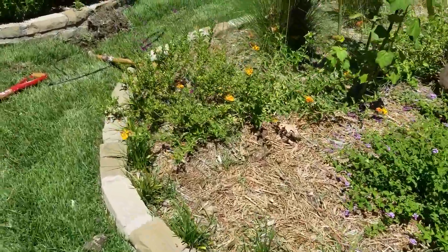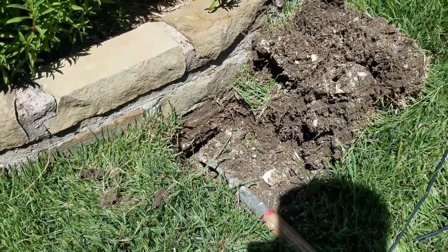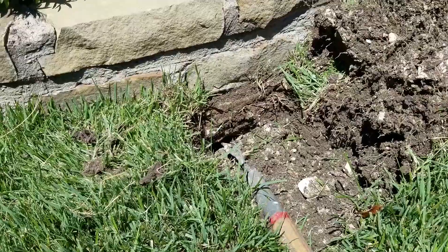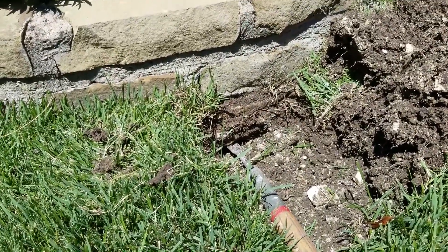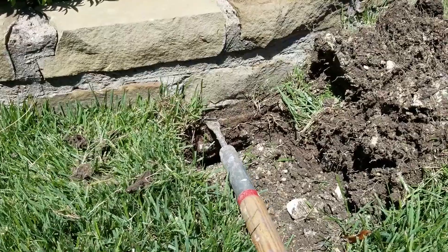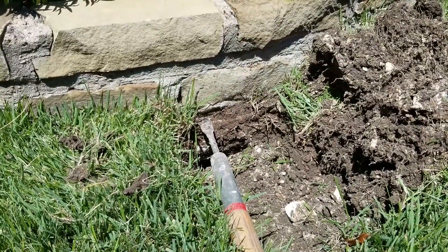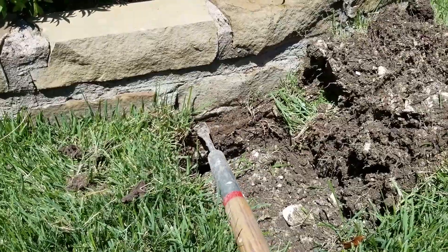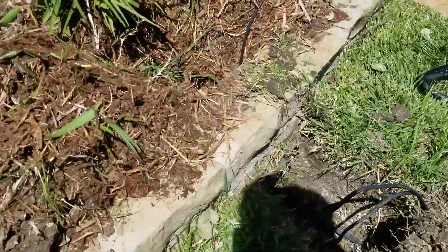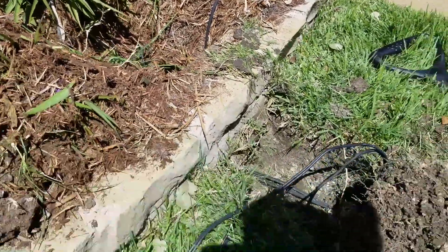One of the obstacles we constantly face here in Texas are these retaining walls. Here I'm working on this retaining wall — you need to dig the grass out and start digging low enough that you can get underneath. This retaining wall is a little bit lower than usual so it's harder to get underneath. A lot of times if I just can't get under, I'll drill right here and run the wire through the cement grout, then put a copper piece so that if the grass moves the wire won't get damaged. We already dug on this side, dug a hole on the other side, and then fished the wire through.